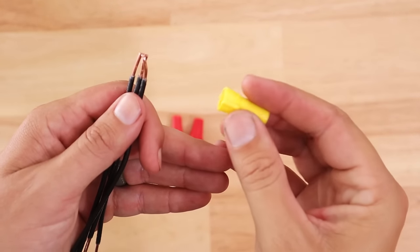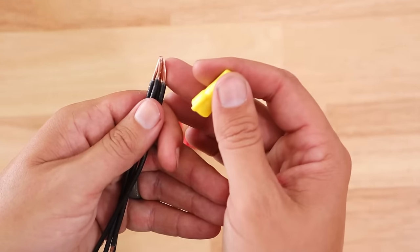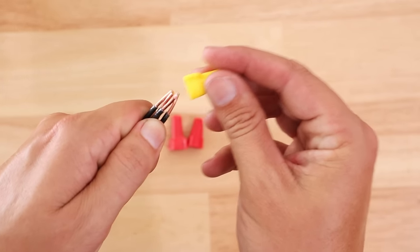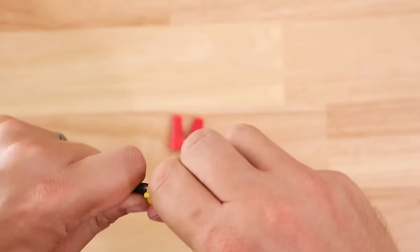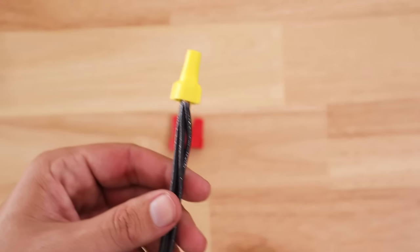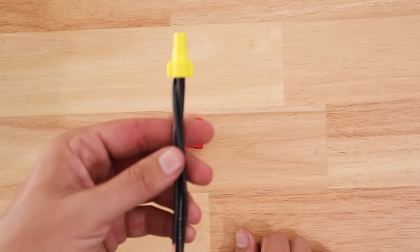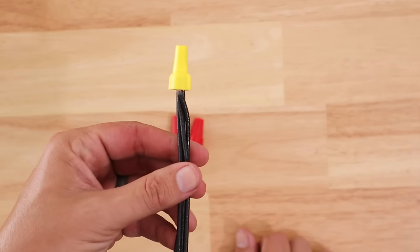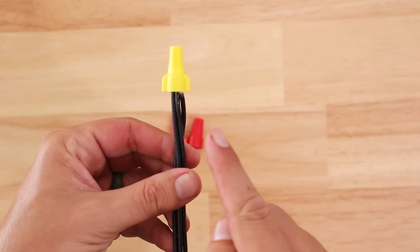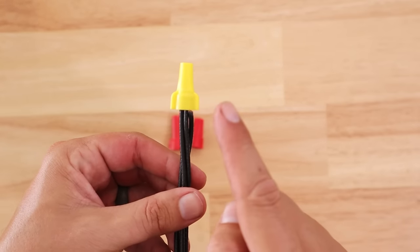So one of the most common things I see being done is people using the wrong wire nut. Say we're working on a switch box and we've got all these wires. They put them together, take their wire nut that they just grabbed out of a box, push their wires up in there, twist them together, and then once they're done twisting they think, voila, I'm done, this is good to go. The problem is this particular wire nut is not rated for the amount of wires of this particular size inside of it.